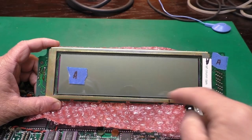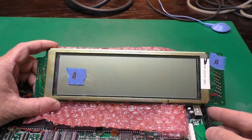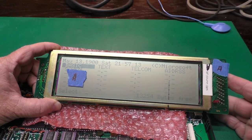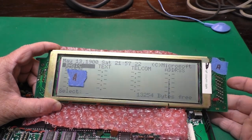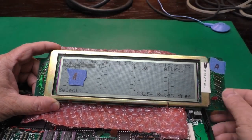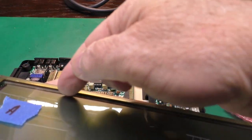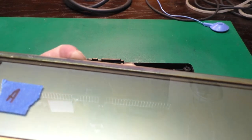I've got my Model 100 down here with the first LCD hooked up - I've put some tags on it so I know which one it is. I'll turn this on now and adjust the contrast. You can see this has a solid stripe right here - some of those pixels are supposed to be on and some are not. I've marked a line where it is. The frame looks to be in good shape, not discolored. Looking down at the zebra strip through here, this one looks really good - no discoloring or signs of corrosion.